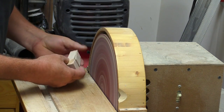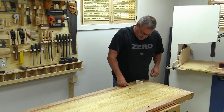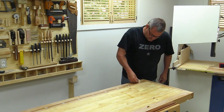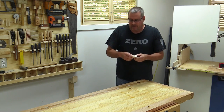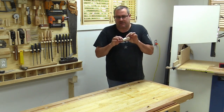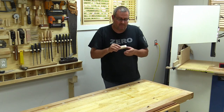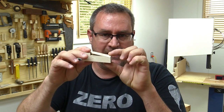Here's the original — push it down. Here's the new one. It's going to take a little while for this to soften up so it slides in as smoothly, and it might need a little bit more sanding. I'm also a little concerned that the glue isn't a hundred percent set up, so I'm not going to push it in and put strain on that spring just yet. I'll leave it overnight — by tomorrow there's no way it'll come off; it would split the wood first.